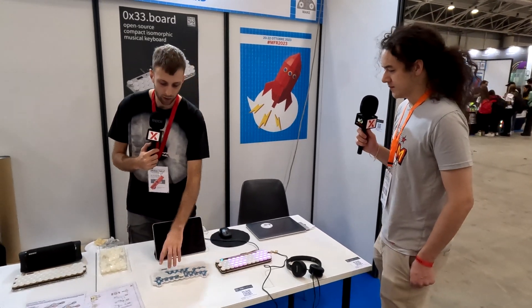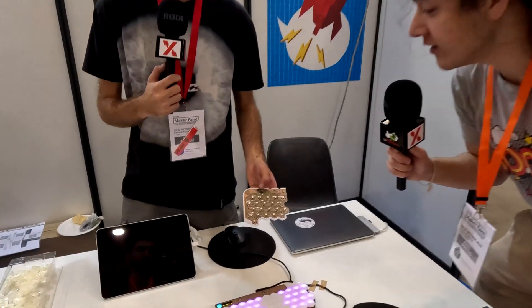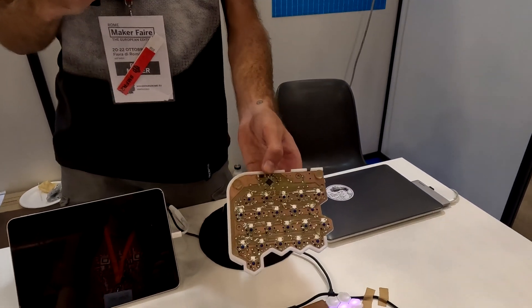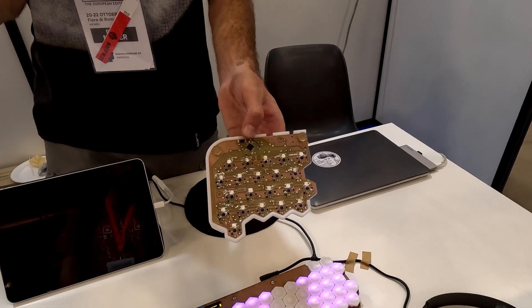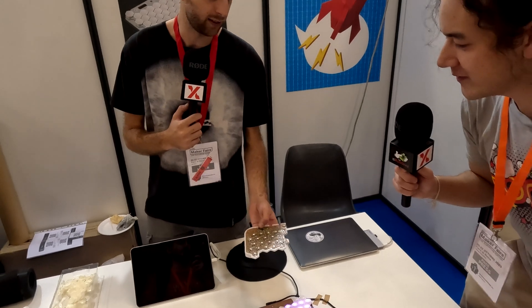I ended up there through some experimentation. This was a musical keyboard when assembled in this state, which is rather similar to this one, or just a mechanical computer keyboard when you separate it into two halves — an ergonomic keyboard that lets you open your shoulders a bit. This is based around the ATmega32U4 microcontroller. This PCB is homemade in the lab — it's a milled, double-sided PCB.